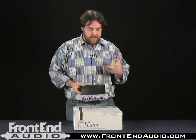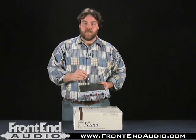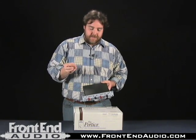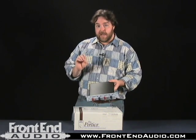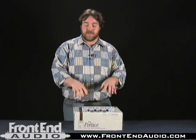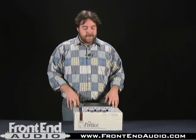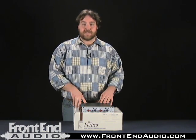There's no tape of any kind here, but there is actual tape head circuitry inside this box for each side. It sports two transformer-coupled inputs and outputs. They're identical line driver circuits for both sides, but there's also actual tape head circuitry — essentially a tiny tape head that's directly coupled to a correctly equalized replay amplifier. Through that combination of tape head circuitry and transformers, you're basically approximating the sound of tape. Having spent a number of years working on Studer A80 tape decks and mixing to those, I was pretty blown away by the accuracy of the sound of this device, and we can really expect no less from Rupert Neve Designs.